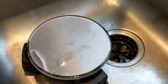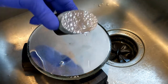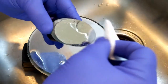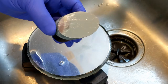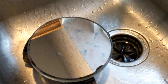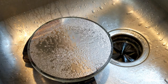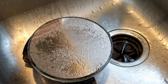While we're letting that air dry, we'll pull out the secondary. I'm going to give it a little spritz of the isopropanol. The secondary mirror hangs upside down so there aren't many opportunities for it to get dirty — I almost didn't need to clean this, but since I was doing one I may as well do the other. I'm just giving a couple of wipes and there we go. With the secondary done, we're going to come back and get the water off the primary with the isopropanol.